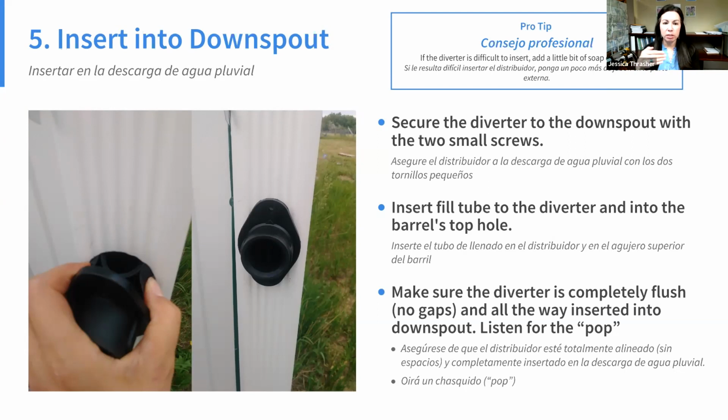That's what your downspout looks like. It looks kind of wavy. So when you put in the screw, it is ready. You need to stop screwing it in once you see the metal come up to your diverter. So it just kind of makes it flush. That's the difference between self-tapping screws and using screws for something else.